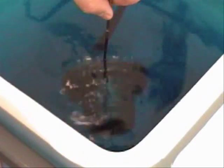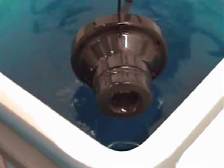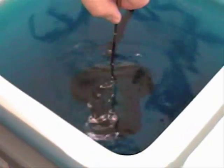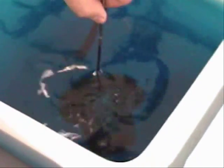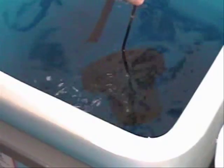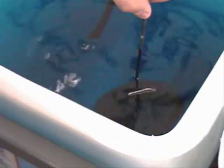The component can be examined after about 15 seconds to ensure that the color has changed. During the remaining time, the component is blacked to about 90% of the desired black. The finish will go to a deeper black when coated with the corrosion inhibitor and allowed to dry.